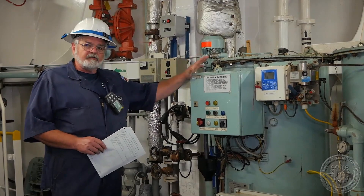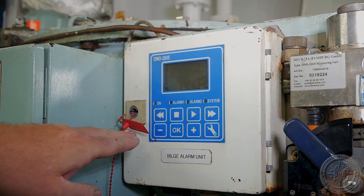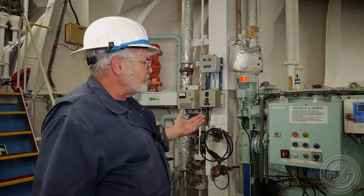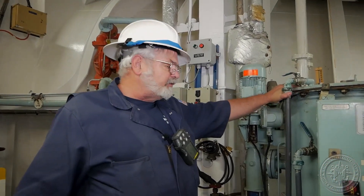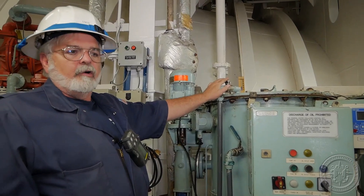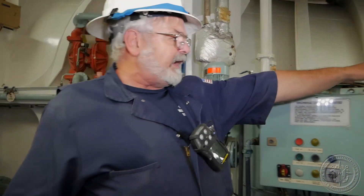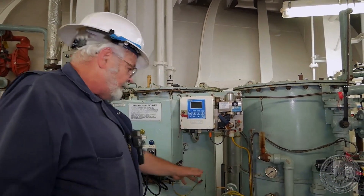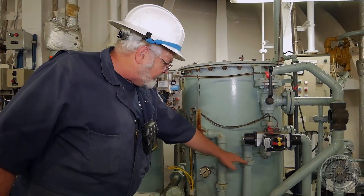This is a 107. Part of the 107 is the oil content meter is going to be sealed. For the visual inspection of the system — on this system here, it uses filters inside. It has two stages, so it's going to do the gross cleaning of the system. It's going to allow clean water to go up to the second stage of the system, and then eventually head over to the side. The piping should be tight, no leaks, no indications that they've opened any of the flanges.